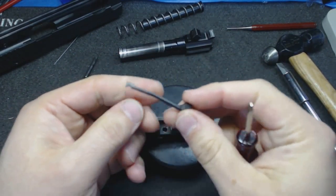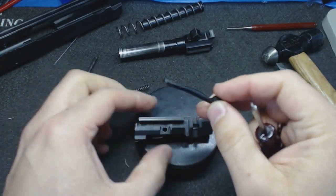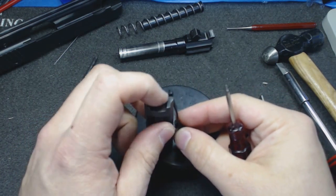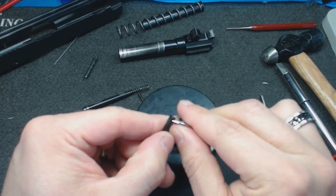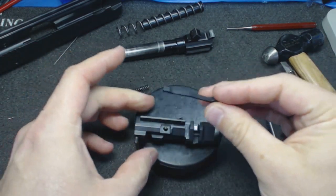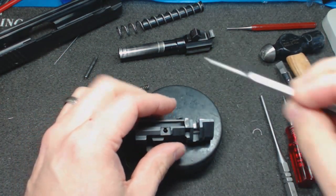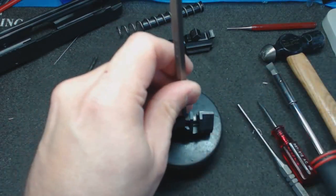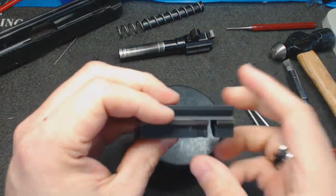And that's it. It should have a bend in it that's going to control how tight it holds onto the round. That bend might be a little different in yours, depending on if it's been adjusted or not. Some of them don't have much of a bend, and then the rounds don't hold correctly, but that's always an adjustable piece in most firearms. So that's it. You can also pop it out to replace it. So putting it back in is pretty straightforward as well. You just push it in there as far as you can get it, and then come in, use a punch to push it the rest of the way, and that's pretty much all the way in. You can always come and just give it one little gratis tap, and it's not going to go anywhere.